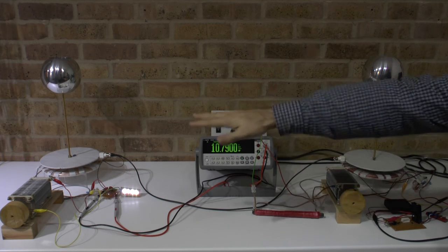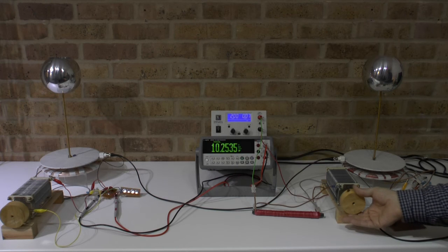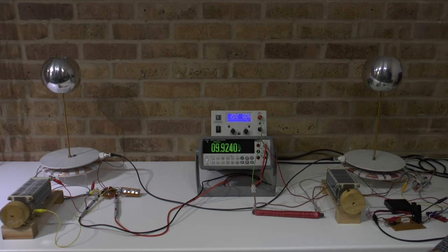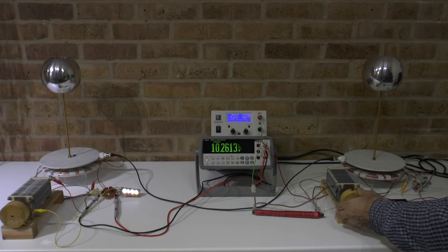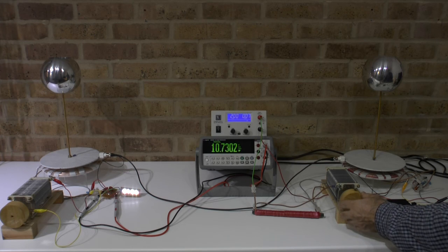I have full control with the capacitor where I can change the impedance on the system. As you can see, if I change that down by even a small value — which changes only by 10 milliamps — it goes down to a value where it doesn't create any energy anymore. So it's highly sensitive, and if I bring that back to my previous value I am back up to almost that level, though it is quite difficult to achieve precisely.